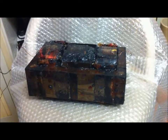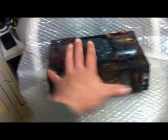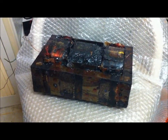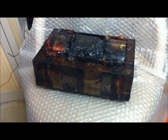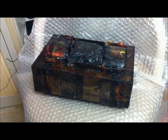As expected, nothing special — it is just a transformer encased in bitumen or tar or whatever you want to call it. But this one is pretty massive. That's a good 250mm I'd say, by about 180 by about 100mm high. So it's a fairly big core, so it would be worth cutting all of these windings out and keeping it, because I'm not sure when I'm going to get another core at that size. You've seen inside a neon sign transformer — that's what's hidden inside these big AC versions.